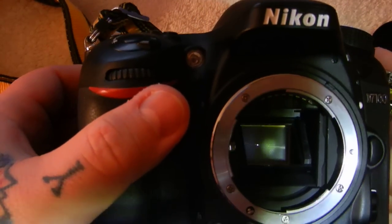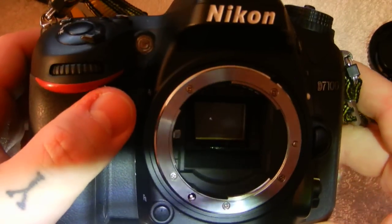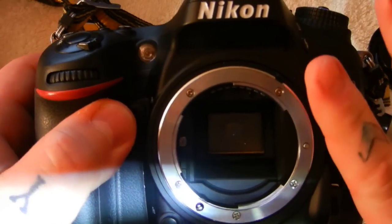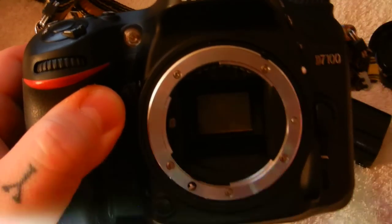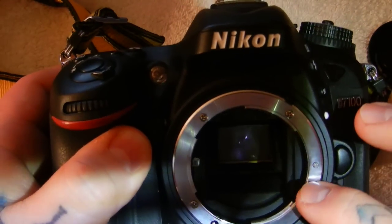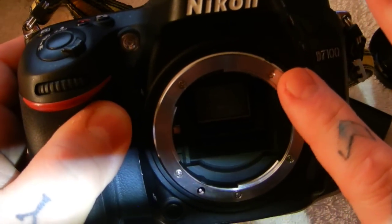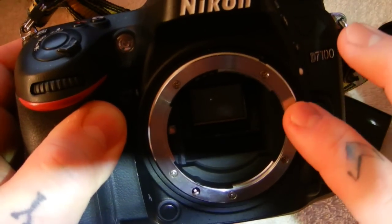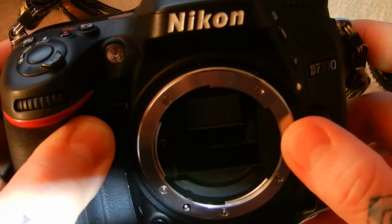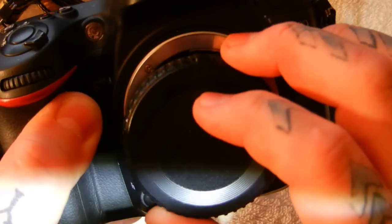I've seen this many times and it's so important to look for, and nobody thinks to look for this. Even used camera shops — almost all of them — don't know to look for this. It will strip the screws which go deeply into the chassis of your body. It's not just about replacing the bayonet ring; you've actually got a bent chassis. As you shine the light at a deep incident angle and look at a steep angle, you'll see warpage around one of the bayonet mounting lug screws — there'll be a little dip. If that happens, reject the camera.